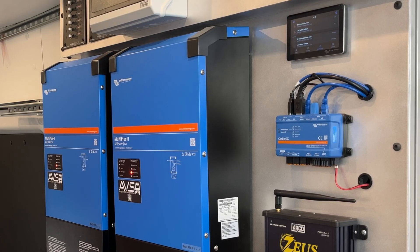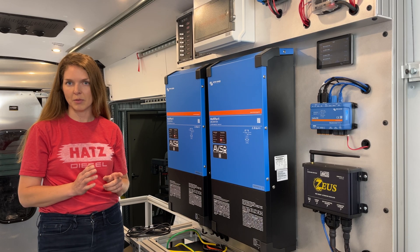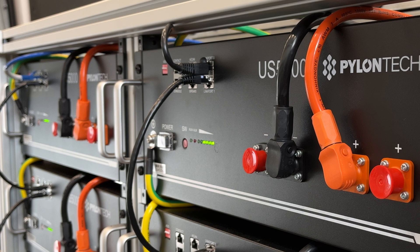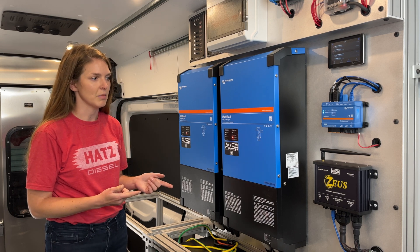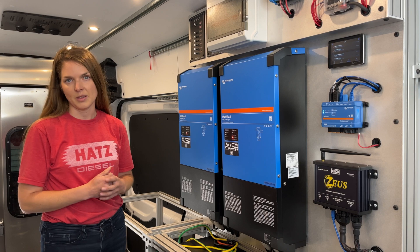With a simple reset, your inverter will default to the internal charging parameters, which is great. But if those defaults aren't set beforehand, we could be way outside of the parameters we want, especially for a lithium battery bank. Victron equipment is designed to be commissioned and there are settings that need to be in place. So let's wake this system up by power cycling it on and off and talk about those settings.